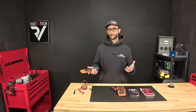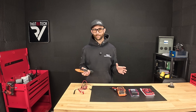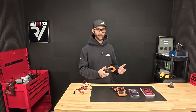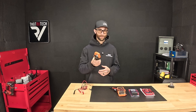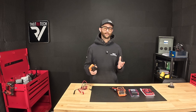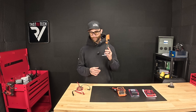The CL800 has an amp clamp. When you're getting deep into troubleshooting, an amp clamp is super beneficial — I can wrap it around a cable and see how much amperage is moving through it without ever disconnecting anything. A lot of meters have an amp clamp, but they only do AC amps. This one does DC amps, and working with big battery banks and hydraulic systems in RVs, being able to see amperage on a DC circuit is super important. Another big feature on Klein multimeters is low Z, which helps you identify electrical faults you might otherwise get fooled by.